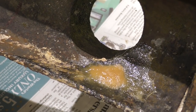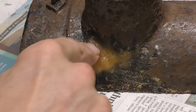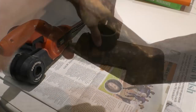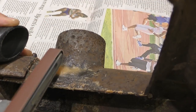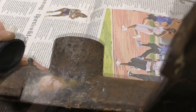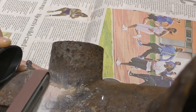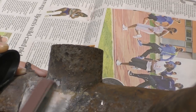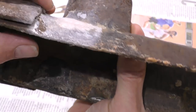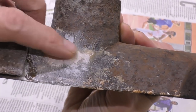Let that go off and I can sand it down a bit. Another five to seven minutes later and that's absolutely rock solid. Morning after — I'm just going to do a little bit of sanding using my belt sander just to take off some of that bulk. Yeah, I'm pretty pleased with that. I don't want to take off all of it because I want to keep some strength in what is already a slightly reduced-strength part of the gutter, because it's rusted away so much.